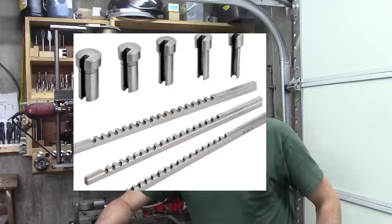Hello and thanks for joining me. Last week I did a boring video — actually a video on setting up a boring head in my mill and enlarging the hole on a pulley. In that video I used something my viewers have named a chisel broach. A broach is what you cut a keyway with in a pulley, and most of the time you have to press them through with some kind of arbor press or hydraulic press. This is not the easiest method to make a keyway, but if you just make an occasional keyway it's a very economical and feasible way. So that's what we're going to do today — make a chisel broach.